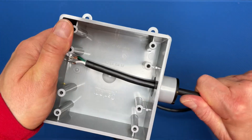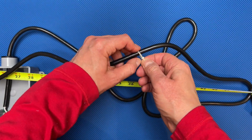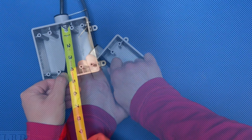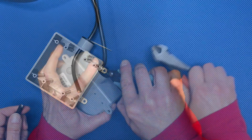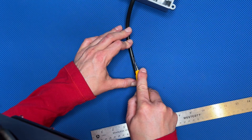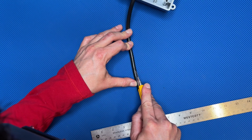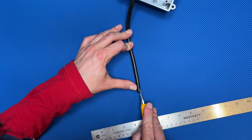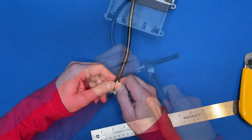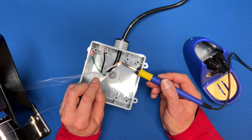Now measure and mark the power cable for the length you want — I went with 3 feet. Pull the cable through the box until the mark comes to the end of the stub. Cut the cord so you have 4 inches remaining in the box and remove your cable length mark. Place a 3-inch mark from the end and use an exacto knife to make a lengthwise slice in the cable's insulation from the mark to the end. Be careful not to cut the wires underneath — if you do, discard that length of wire and try again. Open the insulation along the slice and trim it away, strip a half inch of insulation from the 3 wires, and twist and tin the strands.